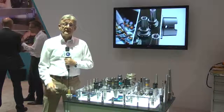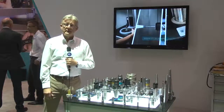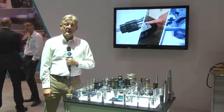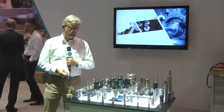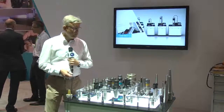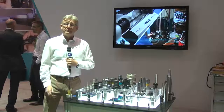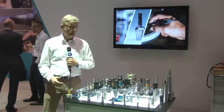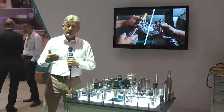The very latest in design is our new synchro collet — a patented product from BILTS, very new. A revolution in the next step of ER collet chuck tapping. Historically the industry taps in a rigid environment. Now we're introducing synchronized tapping for existing tap holders or ER collet chucks to allow you to get the benefit of extended tool life and also perfect thread forms. BILTS not only does tapping — we are the masters of the development of the quick change system, and now we are expanding that technology and innovation into new products which the industry will find extremely interesting.